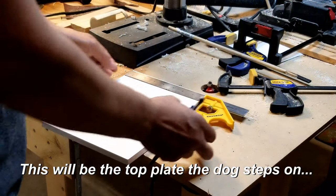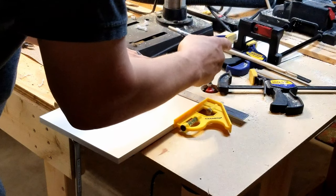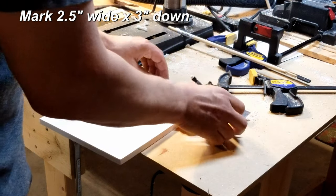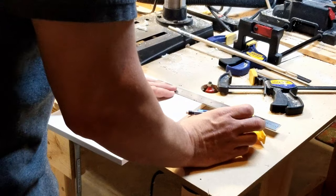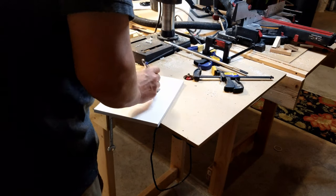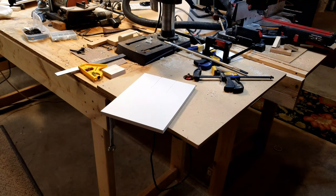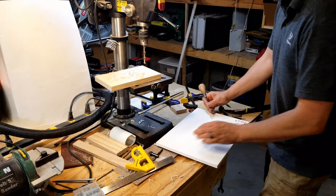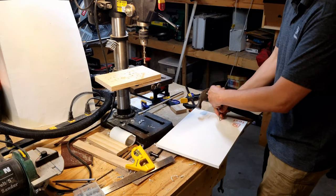Now you're going to need to mark the center line on the top of your board to cut out an area on one of these pieces. Find your center point and mark it - using a pencil is advised. You need a piece that's exactly two and a half inches wide, centered on that mark. You're going to cut this out using a jigsaw, scroll saw, coping saw, or whatever you have. I've got a 5/8-inch drill bit set up here - I'm going to cut in about half that distance from the corners on this piece of scrap to demonstrate how to cut this.